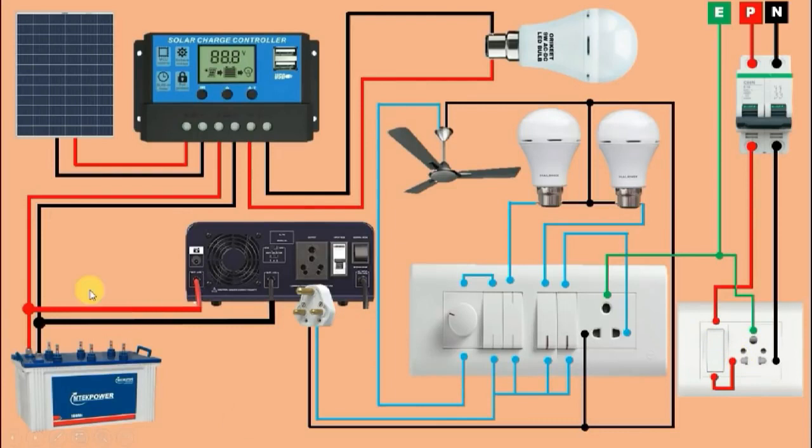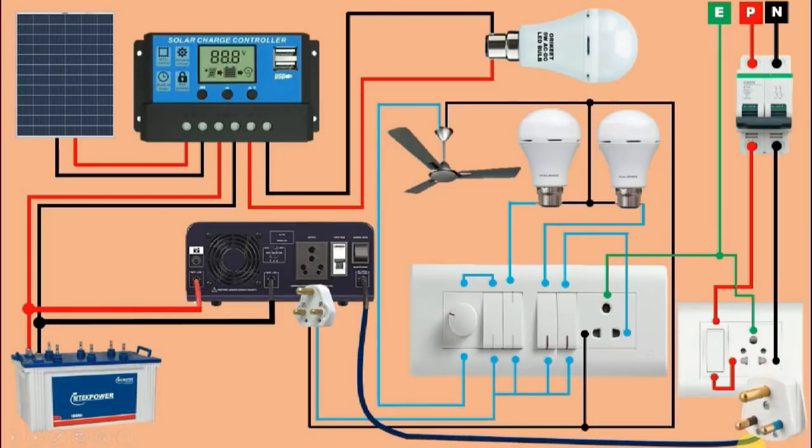Now through this socket I have to provide input power supply to this inverter for charging. I will use a plug top and bring the charging cable from this inverter to connect with this plug top. Friends, don't keep this socket on all the time. If we keep it on, the inverter will supply power to charge the battery. Meanwhile, the solar cell is also charging the battery, so both charging inputs at once may destroy the battery. We use this plug top only when the solar cell does not work — during rainy season or winter season when there is insufficient sunlight. At a time, we must use only one charging input.